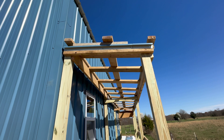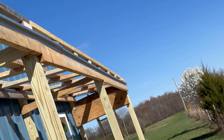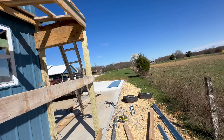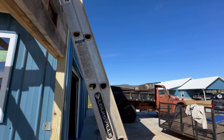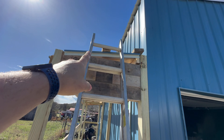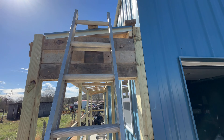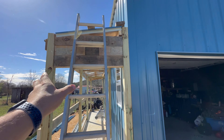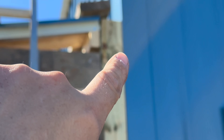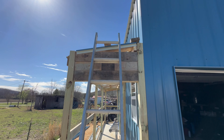All right, I got my J-trim on the end here, all the way down through there. Down here at the end all I had was this big board so there was a big gap — I just threw a bunch of extra boards in here to kind of fill that out and put a piece of J-trim up here. I will have to go a little further on both ends because I tested some corner pieces and they won't cover the little edge there.